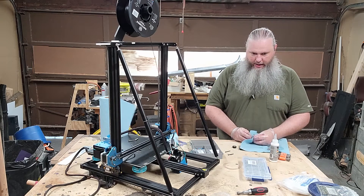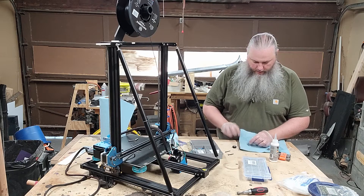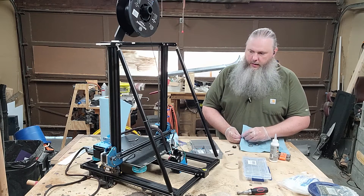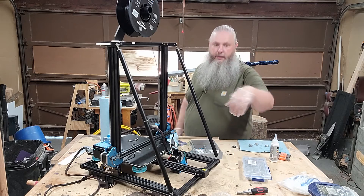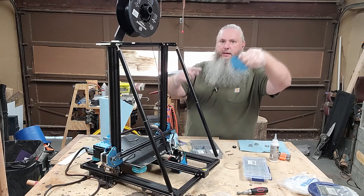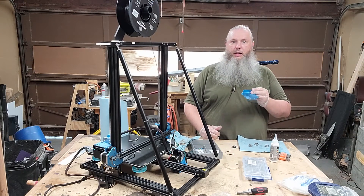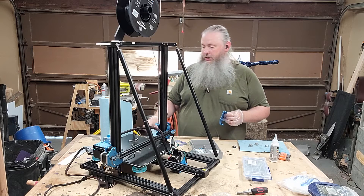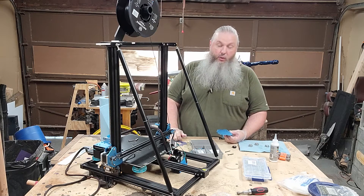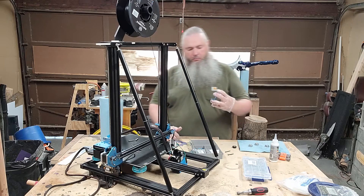Alright, so I'm going to reattach that mounting plate. The first thing I'm going to do is put it on the belts before I put any wheels on there. The belts go over and under this mounting plate, meaning they come through here and go down this V-groove right here. There's a lot of room in there because you can move that belt backwards and forwards to create your alignment, center, or zero position. That's not something I can easily measure, so I'm going to feel it out and adjust it to the best of my ability by hand.